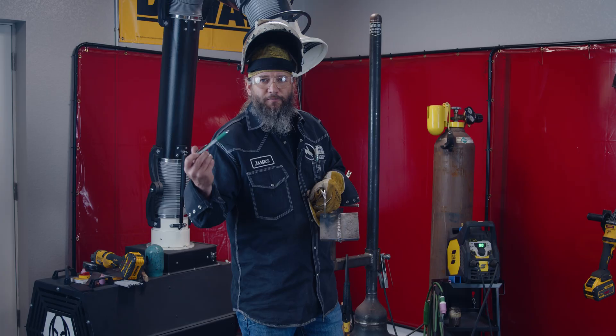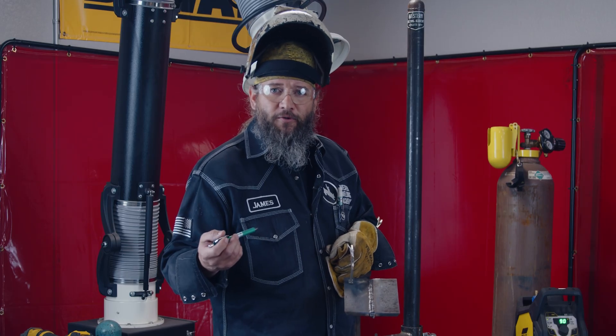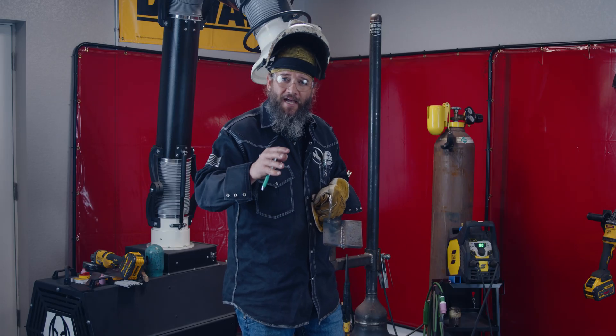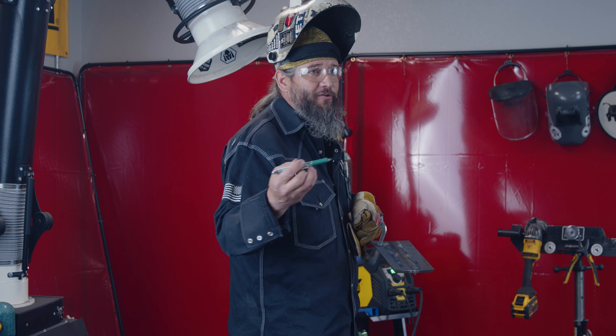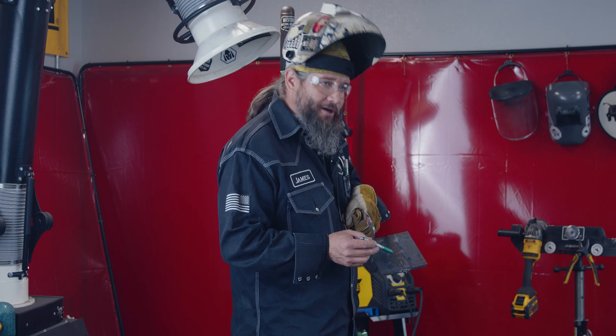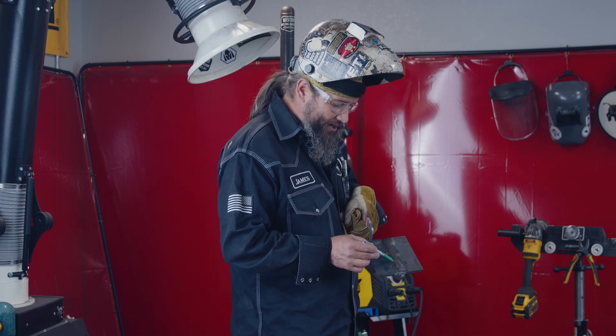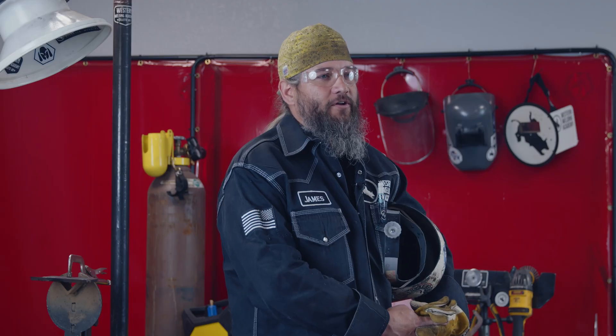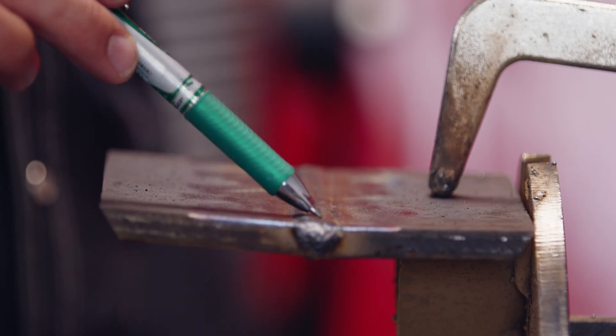So this has been your prep, fit-up, and procedure to weld out an open root joint. There's more than one way to skin a cat - some instructors do this a little differently, but this is the baseline. Because we're not robots, I'll point out that my fill was a little low - you can see a little low spot right here, so always be getting better. That's your basic open root weld. If you want to come show me how it's done, go to applytoweld.com.